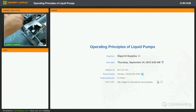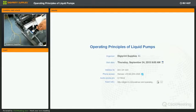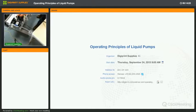So we have a maintenance station here, which has a pump integrated, a pump motor is driving the pump, and we just connected it to the printer so that we can drive power to it. We've got a little bottle here with 2 tubes. So if we activate the printer, and we just put some liquid on the cap, then it's going to be picked up by the pump and eventually end up in the bottle. So you can see it running here. It's a very, very simple operating principle.